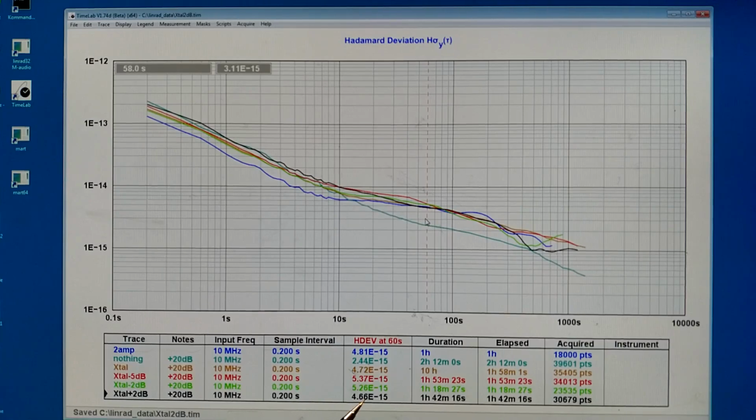And here also. Well, statistics is maybe not good enough. It's 1.5 hours. But since the difference at 10 seconds is reasonably large, well, 7.8, 8.1, not very big. It seems that the original setting is that level I should use, and there was a reason I selected this signal level to start with, because that's where I thought the sideband noise was best.